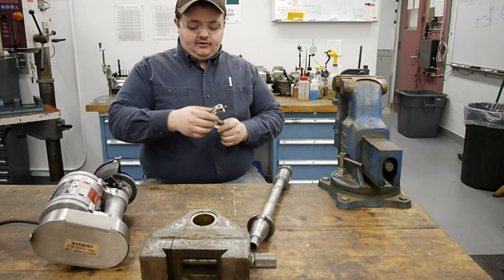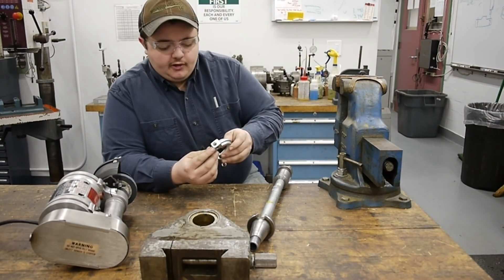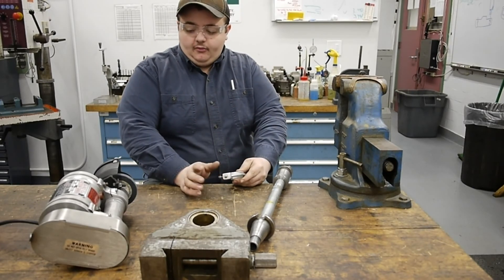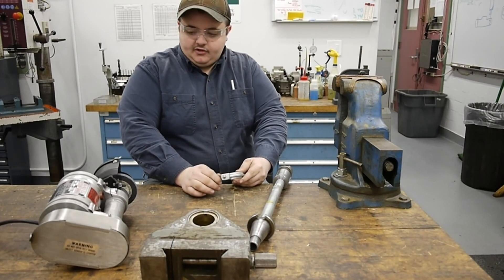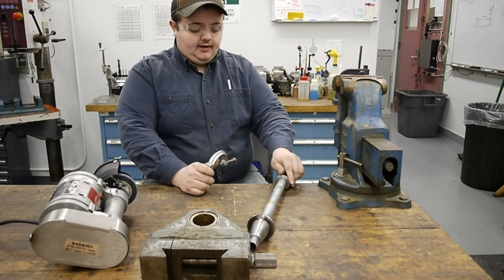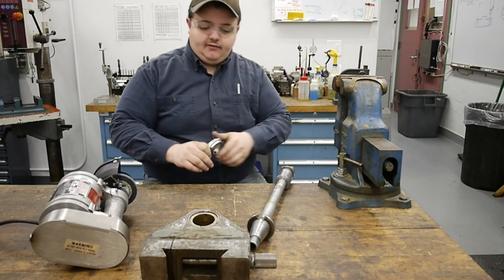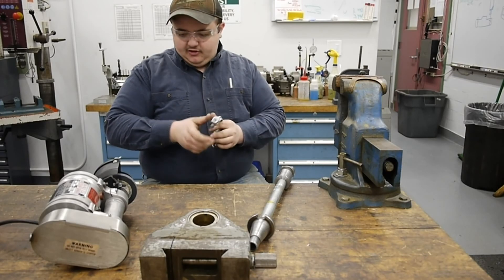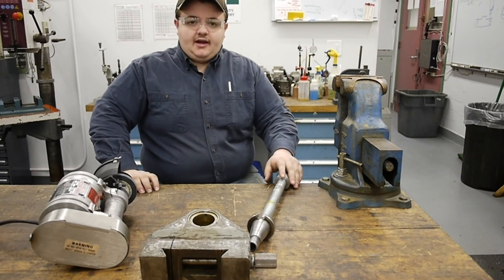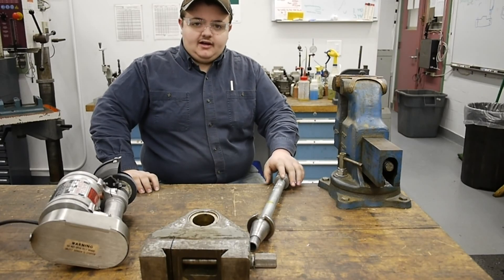In the middle of the video I showed using the tool post grinder stone dresser. This is a diamond-tipped dresser - what it does is give us a flat surface to reference off of for the stones when grinding. The stone is round, balanced fairly, and gives us a good finish. With the grinder we took off about 12 thousandths of an inch total. We left excess material so I'd have enough to pull it into the sides and get it to exactly what we need for this bore. These diamond-tipped dressers are pretty awesome - it's amazing to watch them dress a wheel and it changes the color almost instantly. Anyway, that's a wrap - please like and subscribe if you're interested in this content, catch you guys later.